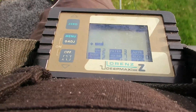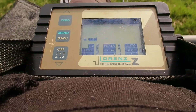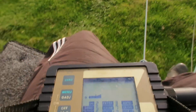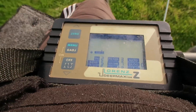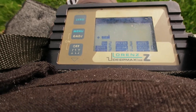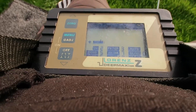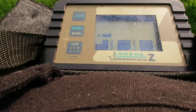With this specific coil — the double loop — that mode caused massive overcompensation. The combination of tough soil plus the wrong mode made the machine basically misread everything. Instead of getting stable, it started amplifying signals, treating that magnetic content like it was metal. That's where all the constant background noise and wild unpredictable spikes came from. The feedback described it as pretty chaotic — not a gentle background noise, but loud sharp spikes and unpredictable wobbles whenever the coil went over even small patches of magnetic clay. The machine was basically overloaded, trying to apply a fix the coil itself was already doing.